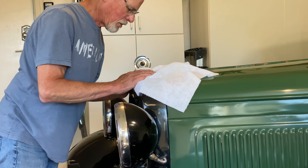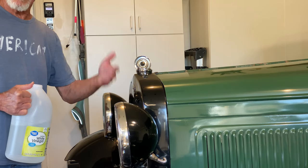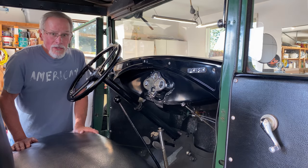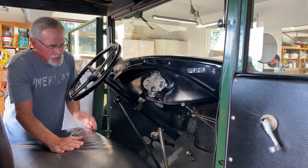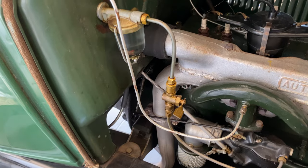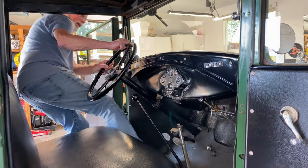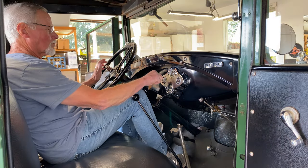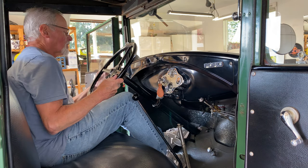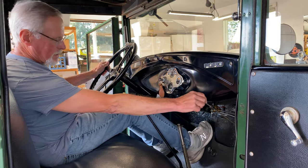Better check — it's more like two and a half gallons. But once I run it and the pump starts moving it around, I'd bet it wants some more. The buzz in the background is my neighbor pressure washing. First I need to turn on the fuel valve so I can start her up. There's a second fuel valve under the hood — gravity fed fuel. Wait a minute or two and then we'll crank her over. To start it up, turn up the throttle a little bit to increase the idle speed, retard the spark, and get ready to pull the choke out.